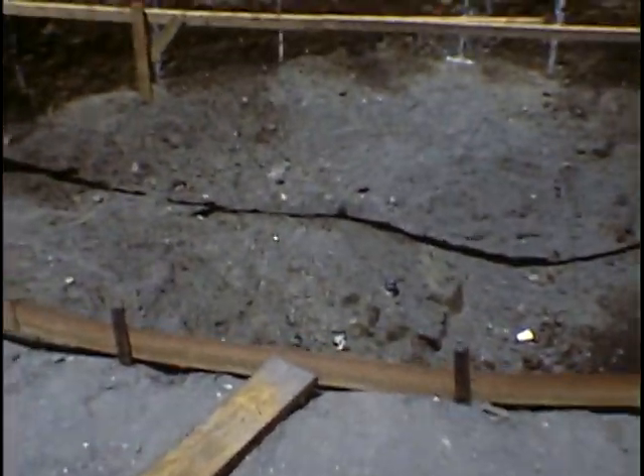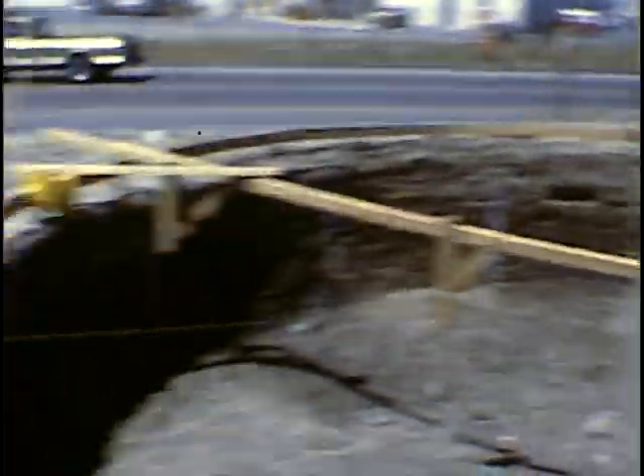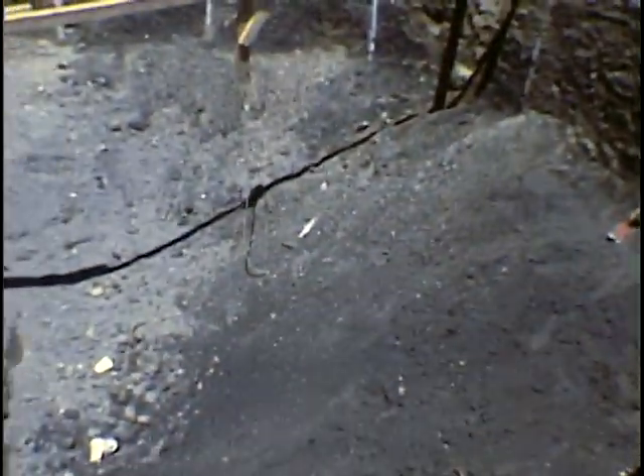There's the drain pipe sticking up. The grader operator only excavated down to about six feet so we could work on the walls, the vertical and so forth without scaffolding. Then he's gonna come back, we'll do the rest of the grading in here, and then the final shoveling and picking to get it perfectly smooth.